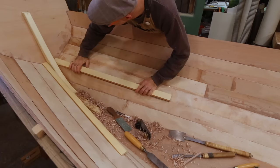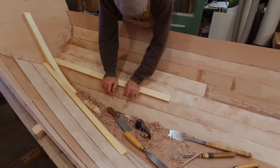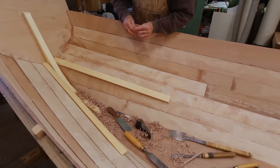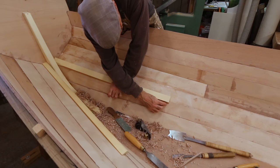And so what I'm going to do is I'm touching up here at the inside corner, and I'm sliding this corner down until it just clears the bevel we've created there. So that's going to spring down into there, and there's a little bit of bounce to this because it's going to have to get sprung into place. So with that position, I want to hold it in its final resting position as much as I can, and I'm going to reach underneath and try and scribe along the bottom with a pencil here.